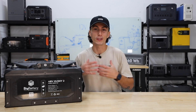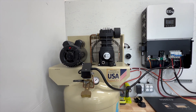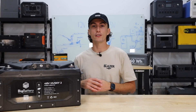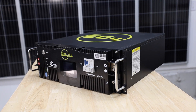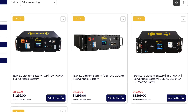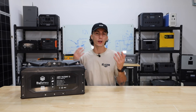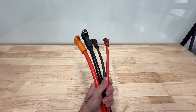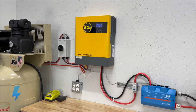If you're looking at building any kind of solar kit right now, 48 volts is the standard. Whether you're building a small or quite a large system, I'd still recommend going with a 48 volt system — it just has so much versatility. You can get an inverter as small as 3000 watts or as big as 18,000 watts. And 48 volts allows you to run the same load as a 12 or 24 volt with a much smaller gauge wire, because you need far fewer amps. You can run a bigger, beefier system a lot more cleanly.